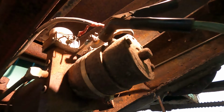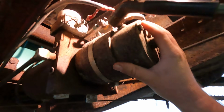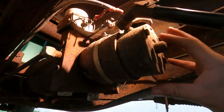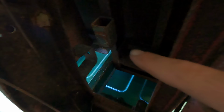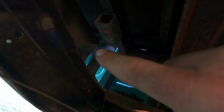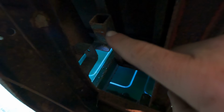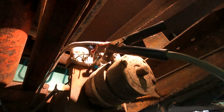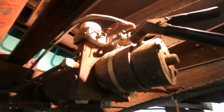So that could be one of two things, right? Either there's something wrong with the electrical up there, or the pump itself is seized, so the pump can't turn. It should rotate one way to move fluid and the other way to move fluid. And the distance between that guy and that guy is the amount that I have already lifted it. But now if we can't go down, I obviously don't want to lift it anymore. We don't want to be 12 o'clock boys with the dumper. We need to get it down before anything else.